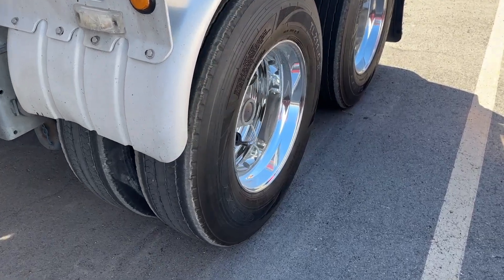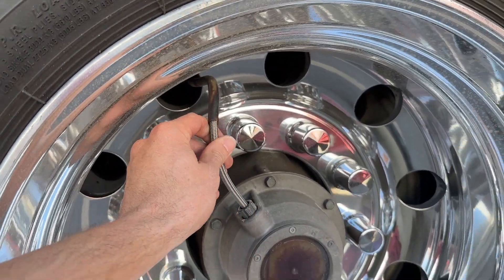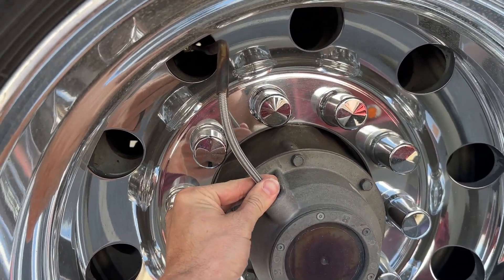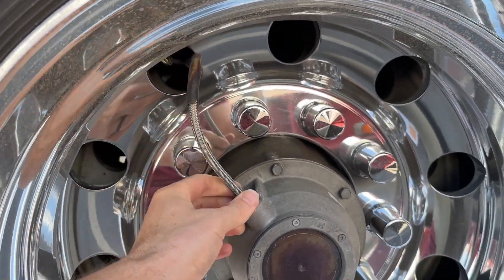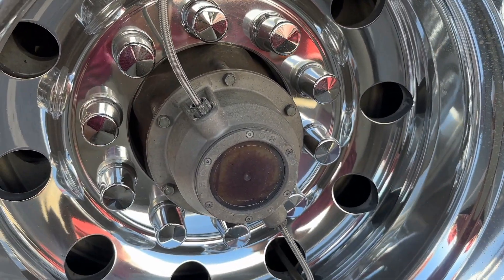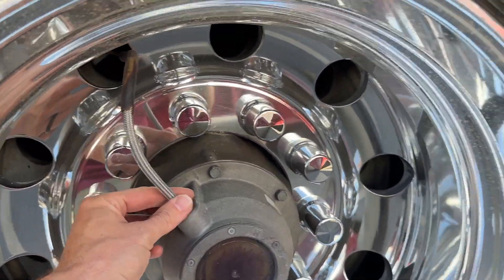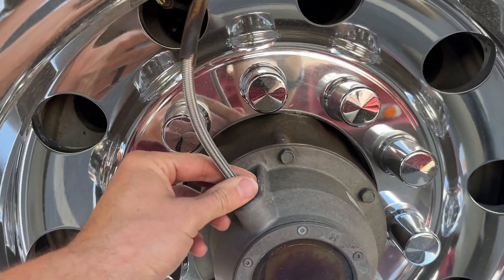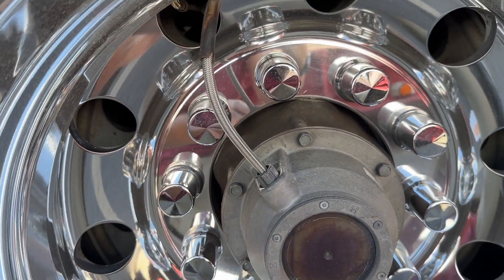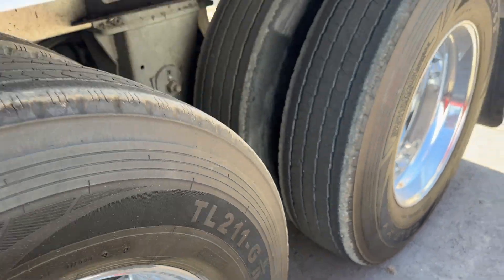Next, these airlines here — this is how the system gets air to the tire. It comes through the hub and goes into your tire. Airlines can go bad, so be aware of that. If you get a tire changed out on the road, these connections are supposed to be finger tight. They have o-rings in there; you don't need to crank them down hard — just finger tight and that should stop leaking. If it's still leaking, just the tiniest turn with a wrench if you absolutely have to. Also, if you want to double-check your system, you can unscrew this fitting from the hub — it has a stem — and just stick your tire gauge on it. That way you can find out what your system is actually charged to and tell the mechanics if it needs to be adjusted.